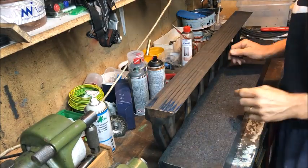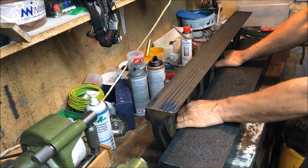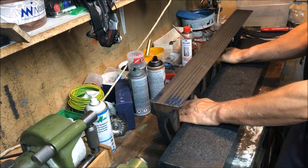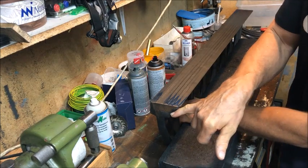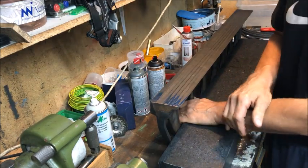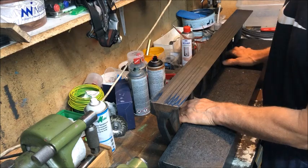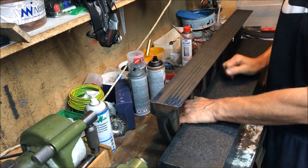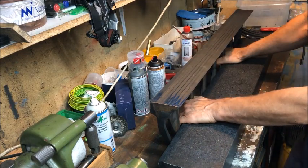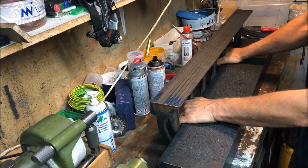Just returned from planing the straightedge — the 36-inch Kingway HKA, which is Richard's designation of the straightedge with the dovetail capacity. We did the angle way at 44 degrees, so that will fit into a 45-degree dovetail also. We did only the angle way and the flats. That was what we managed in 12 hours, mainly because it was the first attempt running the machine, so we had a lot to learn.